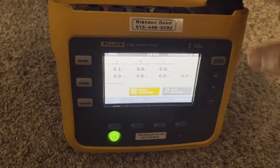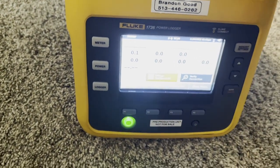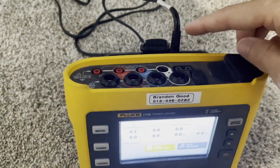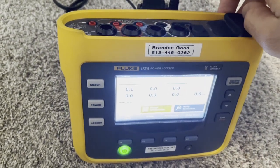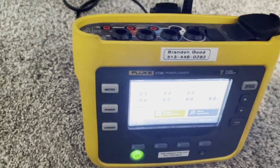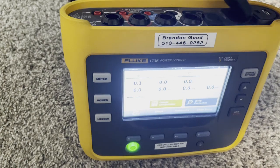Now we're over at the 17-30 series. We're going to take the flash drive we had, already loaded the firmware onto, and plug it into the USB port. Before that, I did want to mention: anytime you're updating firmware in any Fluke tool, make sure you plug it in. Don't just run on battery power, because if you're halfway through your firmware update and the battery were to die — bad news bears. You get to send it into Fluke and wait a long time before things get fixed. But if we just have constant power, we have a much better chance of not having anything go wrong.